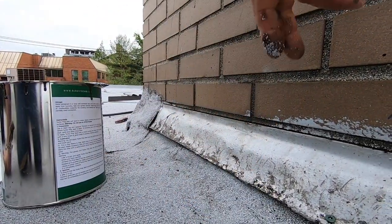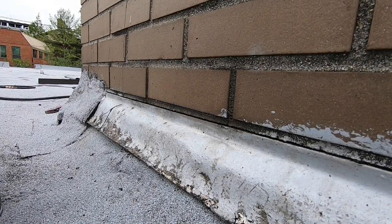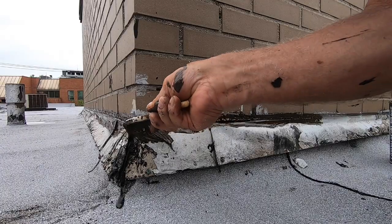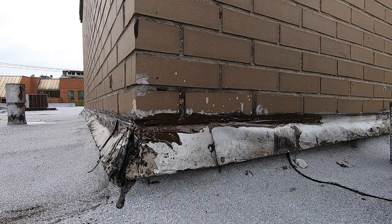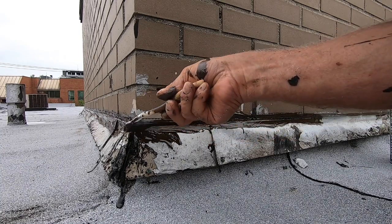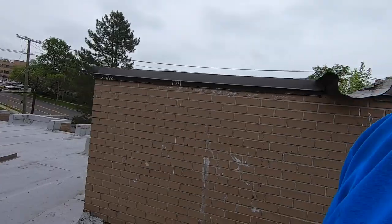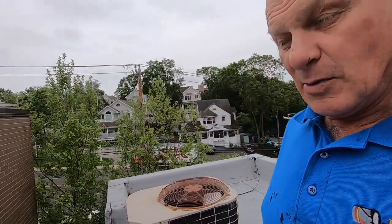The cracks here — I don't know if you can see it in the video — see the crack there? That causes leaks. So what I do is paint this Polyseal right into the crack. Water can go in there, so I flow the Polyseal in and it will seal out water. It dries and water cannot get in. I've sealed it and made the flashing — this will never, never leak. I'm the flat roof doctor. I know a thing or two. Turbo Polyseal is unbelievable — I use it for anything.